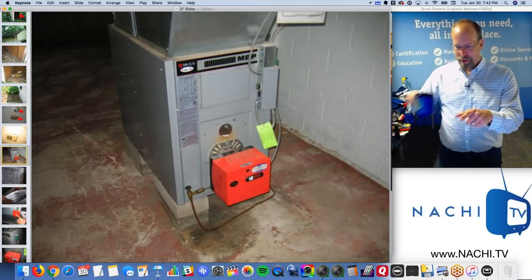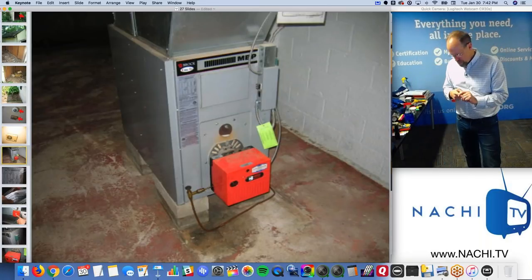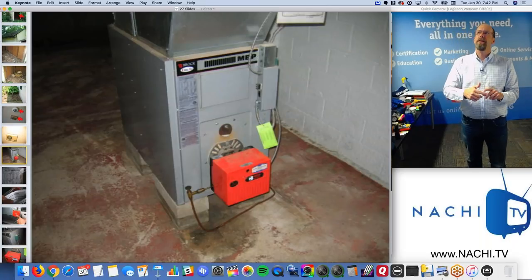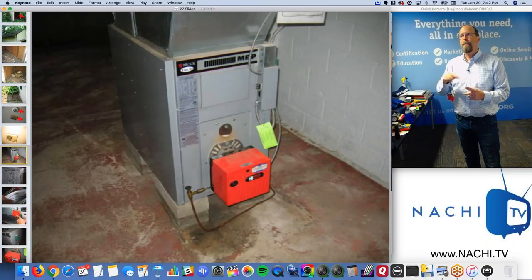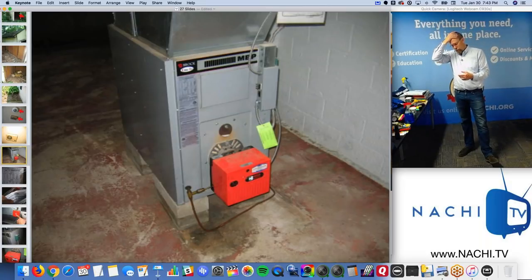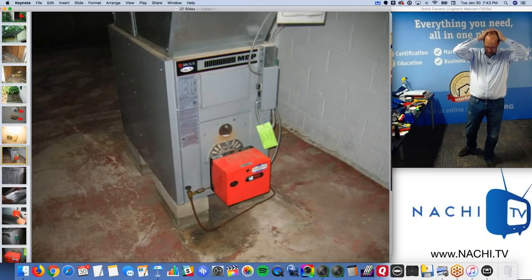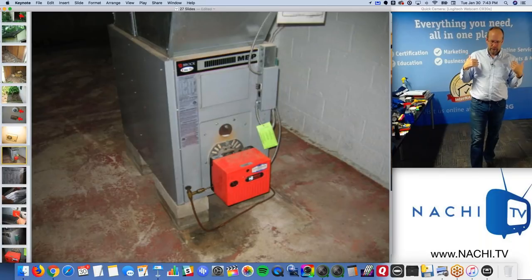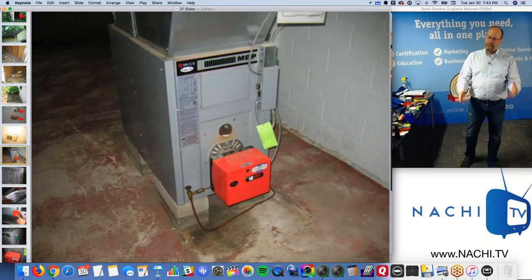But at this point in the home inspection, remember that it started at 8 o'clock? Down from the roof, shaking the hands, 8:30. Exterior, I did another probably 40, 50 pictures. So now I'm at 100 pictures, and I'm at about 9 o'clock, right? The beginning of a home inspection is somewhat slow sometimes, because you're getting a really good idea of the condition of the entire home when you look at the roof. The roof really is a great indication, in my experience, of what's going on in the entire rest of the house. If the roof is shot, the inside is going to be not all that peachy clean.